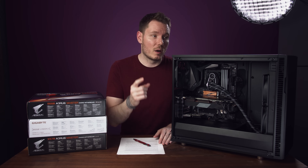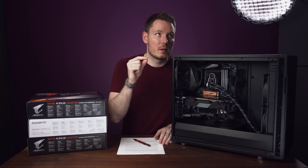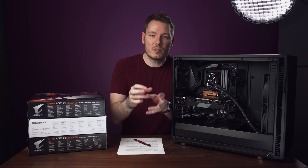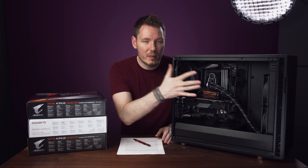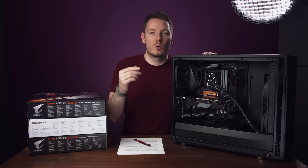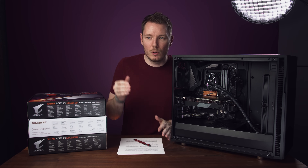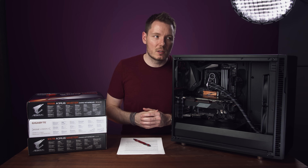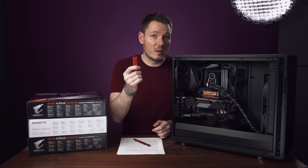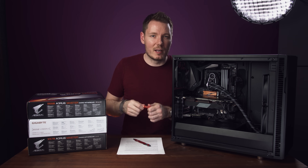So that's issue number two. But when I put the GPU under load — issue number three — that sound does come back, though it's a lot quieter in the setup that has proper continuity/grounding. It turns out it's actually coil whine coming from the GPU — if you get your ear right up to it, you can hear it from the GPU. And I think because of the grounding issue, that sound gets through into my speakers, where it doesn't when using the USB Defender thing. Which is interesting — why would a USB ground loop isolator prevent the coil whine from being heard, unless the coil whine was being aggravated by the ground loop?